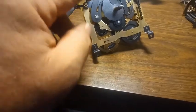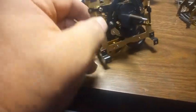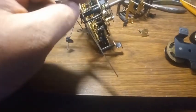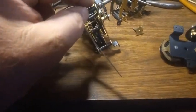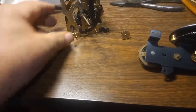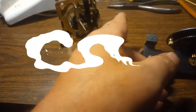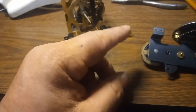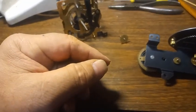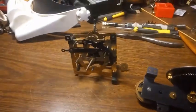But even with the thing completely flat — the movement completely flat — you still can't take this post off the front plate of the movement. So in order to fix the clock that we had been working on all day, we had to take a spare movement and take every bit of the time side components out to put on this Hones eight-day musical cuckoo clock. And that was a lot of work.